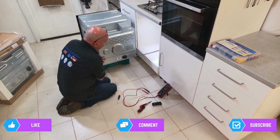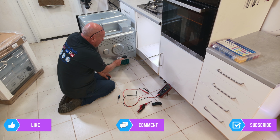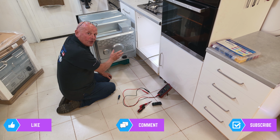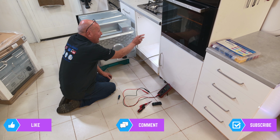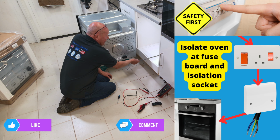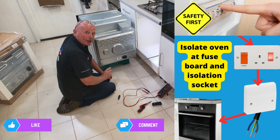Once you've got access to the cable and you're able to release a little bit of slack, we can now look at the junction box. But at this point, it's very important that we isolate the power. I have already disconnected this cooker from the mains electric. You may have a plug now which you're able to unplug from behind the cooker. You may have a hardwired cooker, meaning this cable is actually fitted into a junction box in the wall, but it may have an isolation switch which you need to turn off.